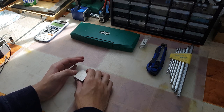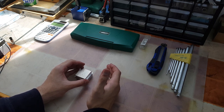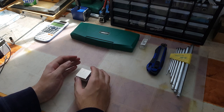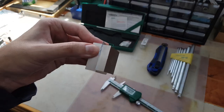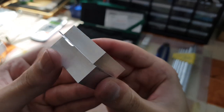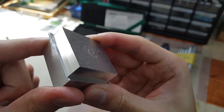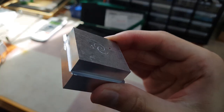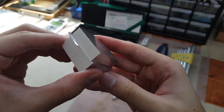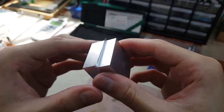For the third test, I cranked the I-term up to something like 40, and my P-term was 40 for both axes. Let me show you the finish — this top one is a bit reflective. I didn't finish it with the mist coolant because I thought there might be some interference — I'd had that problem in the past. Let me make sure the ways are clean. This is the X-axis — exactly zero. This is the Y-axis — also looking great.